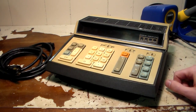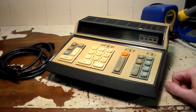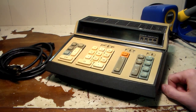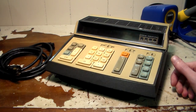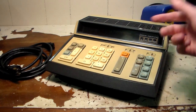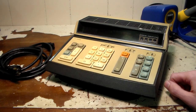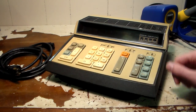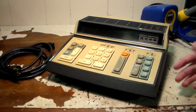This particular model has what's called a Panaplex 2 display — that's just marketing speak for a gas discharge display, kind of like a neon sign where there's gas inside a sealed glass chamber and filaments go in and light up the numbers. Modern calculators today have a vacuum fluorescent display, but this uses gas discharge. It's got an orange hue to it when you look at the readout. It's actually very cool looking, not as cool as a Nixie Tube, but for what it is, it's pretty interesting.